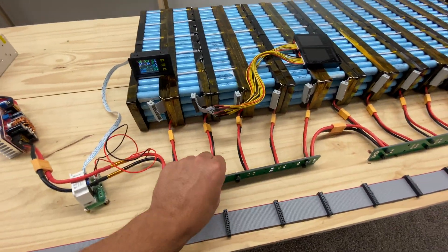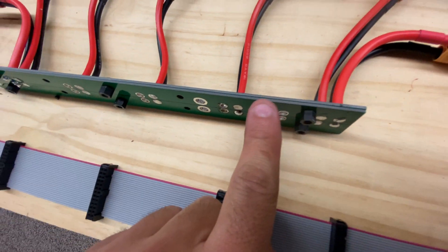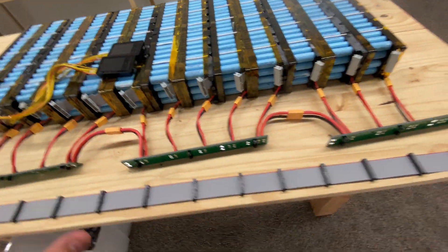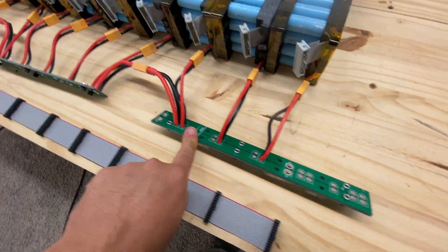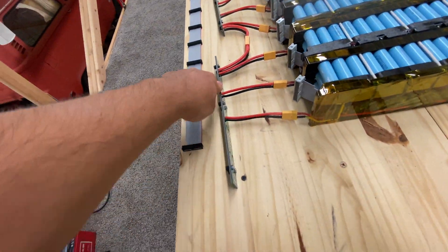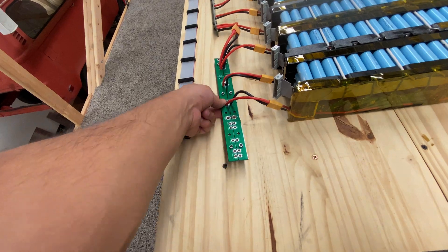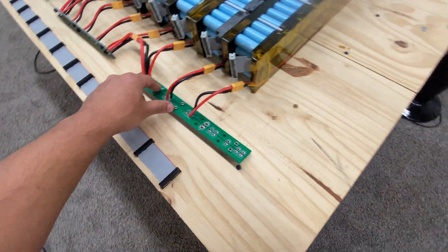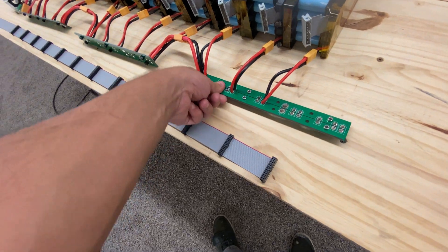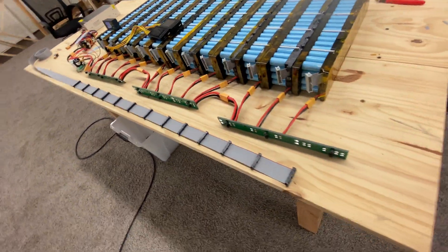I'm using these DC power strips that I have on the website. I doubled them up, as you can see here — they're doubled up, so two of them. I will load test them and see how well they do. I think I have a video where I load tested these in the early days, and I think a single one will do like 80 amps. It gets kind of hot at 80 amps, but you could kind of run it hot. That's about the max before it starts getting real dangerous. Obviously you don't want to run this stuff too hot because then it's just energy being wasted.